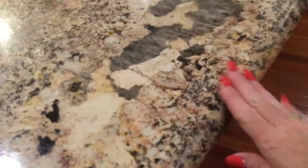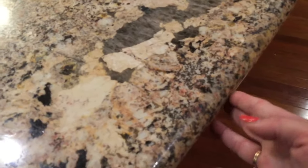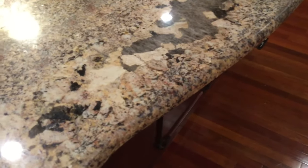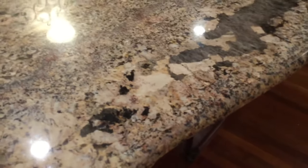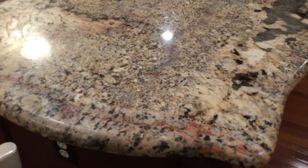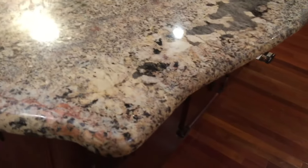When you're picking out your granite, you choose your edge cuts. Mine is called a bull nose — it's a half bull nose, where it's rounded at the top and then flat at the bottom. It's nice to do your island with a slightly nicer or more expensive cut than the plain — it just draws attention to the island. The rest of my cabinets I did with a standard bevel: basically a squared-off end with a cut on the top so it's not so square. Mix and match if you want — it's more custom that way.